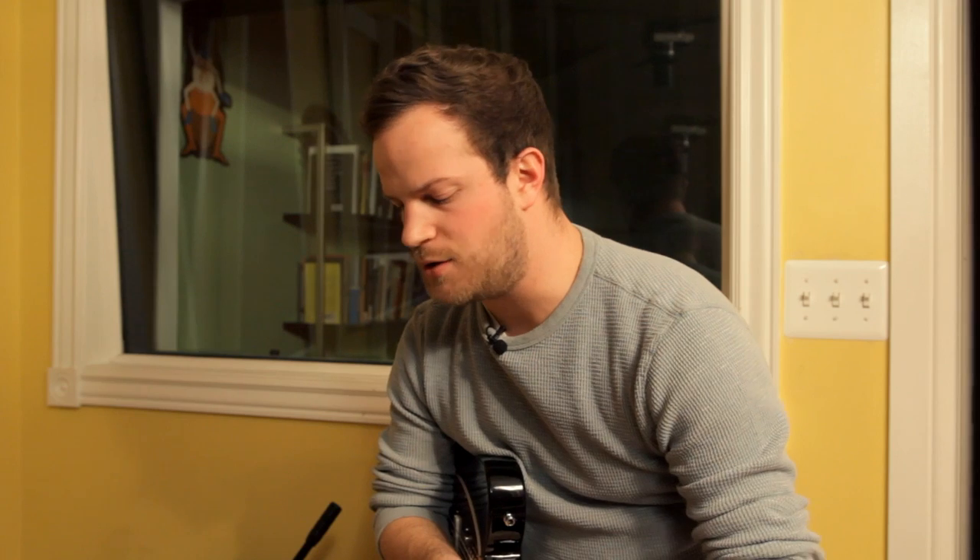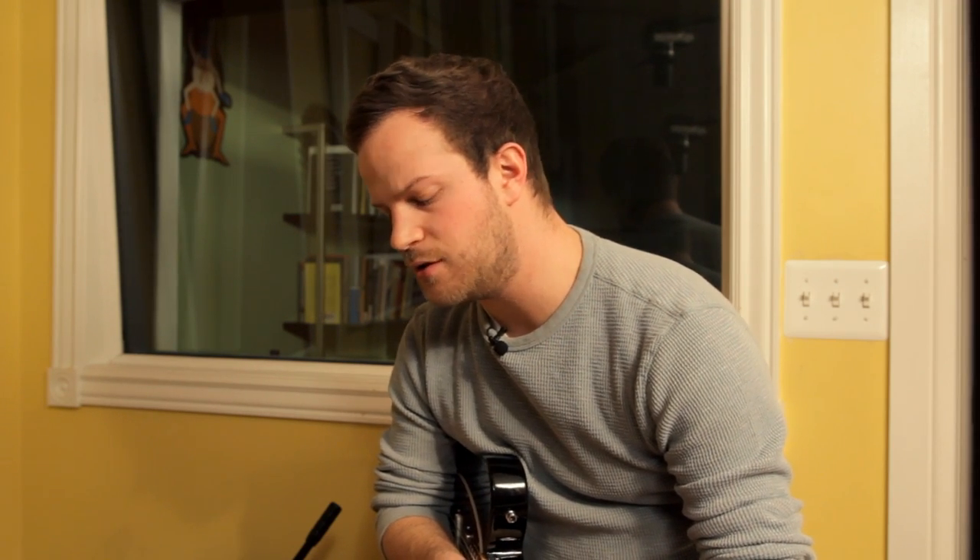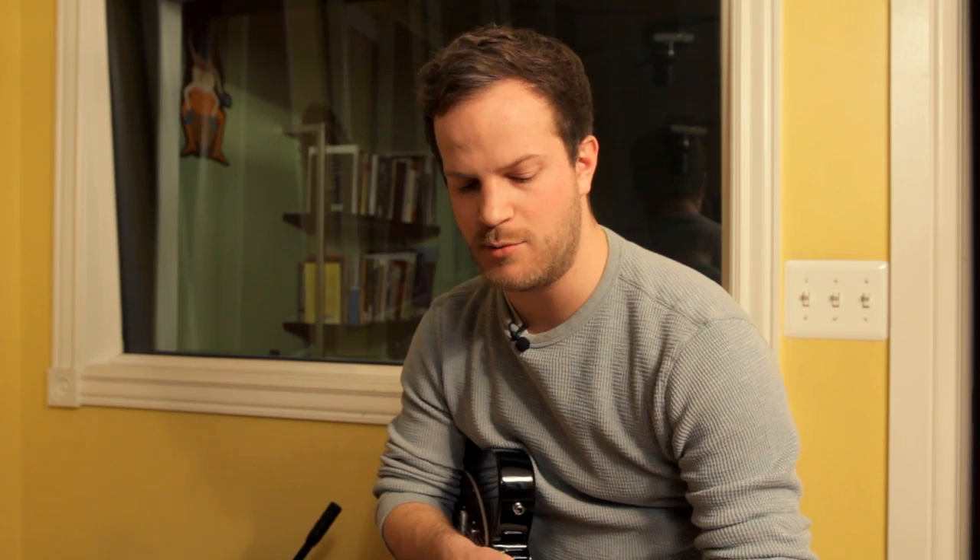I've called up a bright crunch setting on the 1904. I've got the two clipping switches to the right, and I've got the volume and tone fairly high up, but the gain a little bit down. Let's check it out with some open chords.